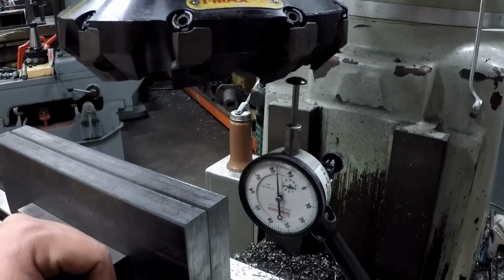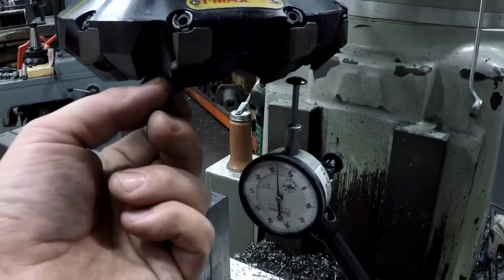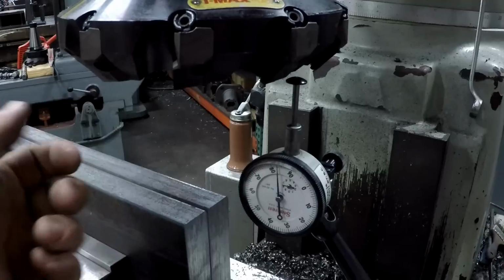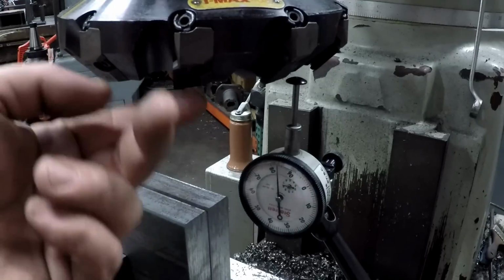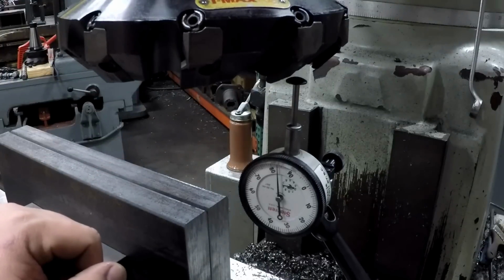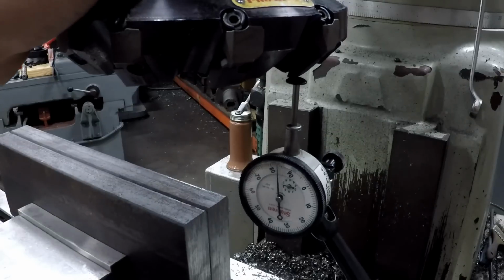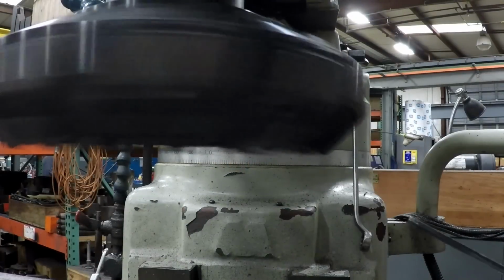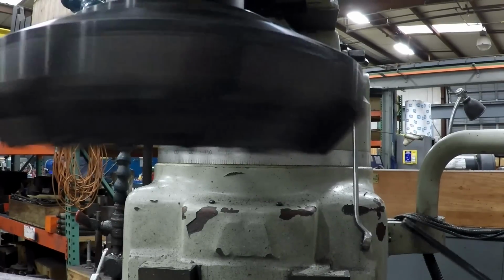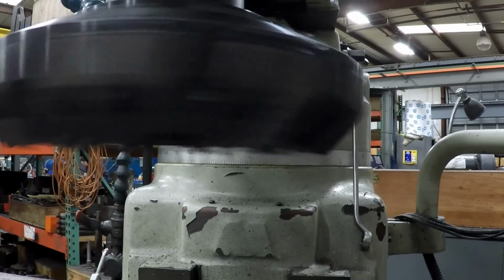It's a really different system than what I'm used to. It's got a spring-loaded deal in there also that helps hold that insert in there, which is what these guys are up top. So part of that is spring-loaded, and I have to actually tap the insert in there with a nylon hammer to get it to seat. So we got it set now. I'm gonna see how it does. Let's go make a cut. You can just look right there where the insert comes around and see they're pretty much all in line. A little bit of fluctuation you see is that little spring-loaded seat that helps pull it down.